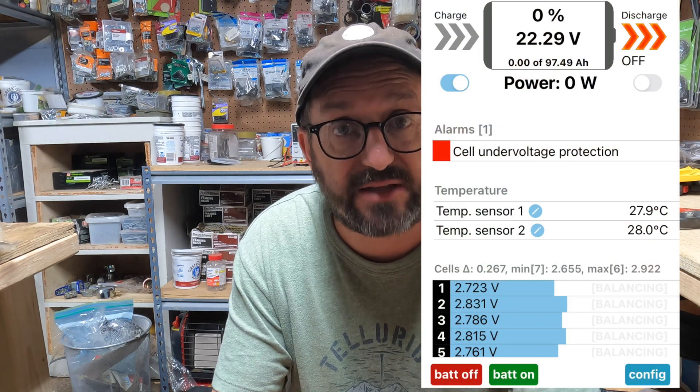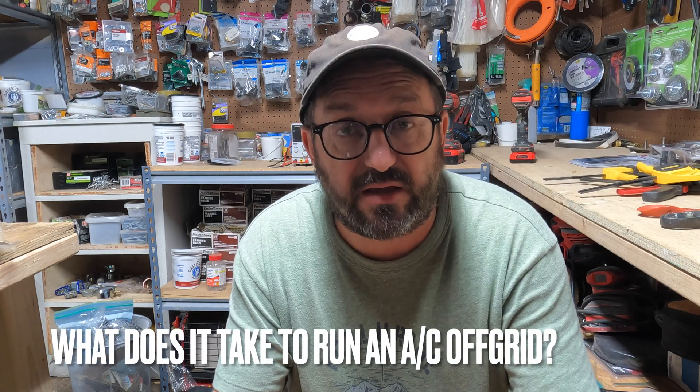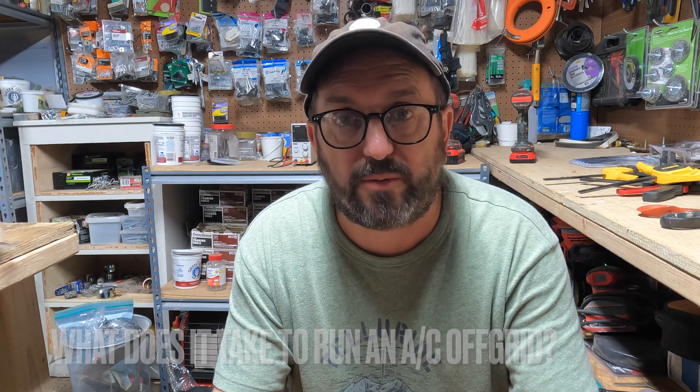The test is completed — the battery is now drained and empty, everything's shut off. So I can now answer the question I originally posed at the beginning of this video: what does it take? This 2,500 watt-hour battery was able to run this air conditioner for almost 24 hours. For my setup — an 8x10 building in the shade, insulated, in a place where it got 95 degrees during the day and 65 degrees at night — a 2,500 watt-hour battery setup was perfectly fine.